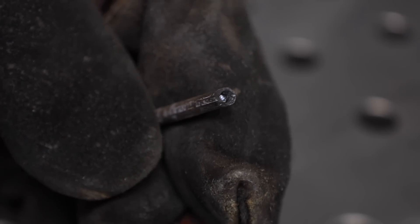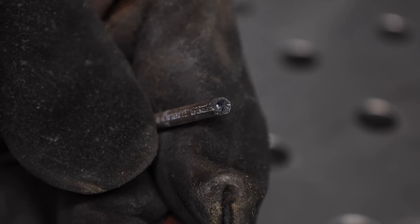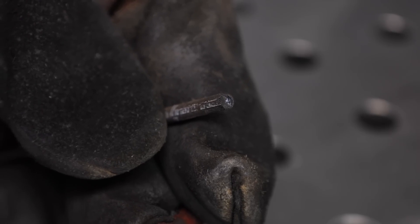I've put in tack welds all the way along this plate to see how that goes relative to other rods. It's really easy to strike an arc with this electrode compared to others, though you still need the skill necessary to do it. One thing I noticed is that the electrode does burn back into the flux — pretty similar to a 7018 — but you don't get that slag that drips over the end you have to chip off when you break your arc like with 7018. It's definitely easier than 7018 to relight, as long as you break that flux off with your glove.